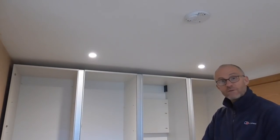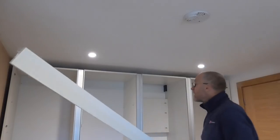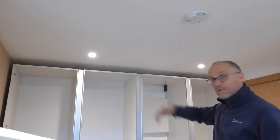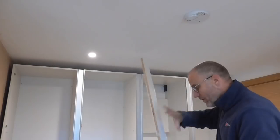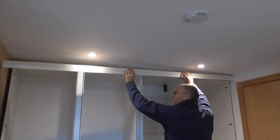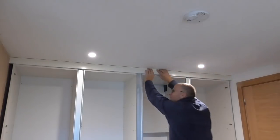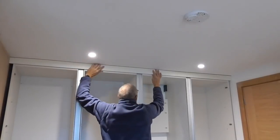Right, I've got it, I've cut it. This has come straight off the saw, so no cheating here. What I've also done here - because this filler panel isn't flush with the carcass, it's standing off 22mm to end up being flush with the doors - I've put this extra bit of MDF on, which enables it to stand off that 22mm. So let's slide it in and see how it looks. I cut this on the saw but couldn't film it because it's just gone carnage with other guys working around. This is where the magic happens - it slides in there. Look at that, it's so cool!